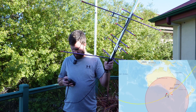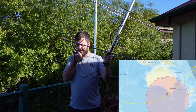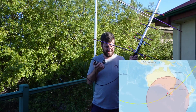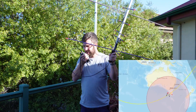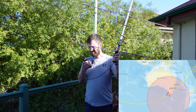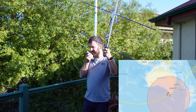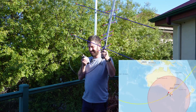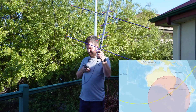There it is — I just heard it key up. Victor Kilo 7 Hotel Hotel on the ISS. VK7MRS, VK7MRS — yeah, VK7HH, your signal is 5 and 9, got you good. Yes, all good here, 5 and 9 also, over. Good. You on your SARCnet tracker, that's working well. Roger that. Not using Doppler, just changing the frequencies manually at the moment. QSL, QSL, doing the same. Very good signal — I think it's right above us now.